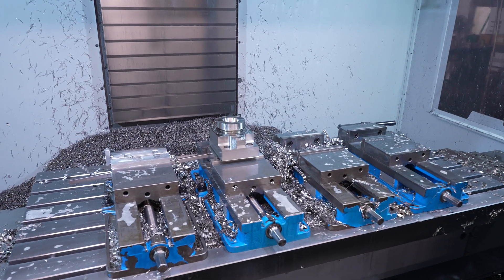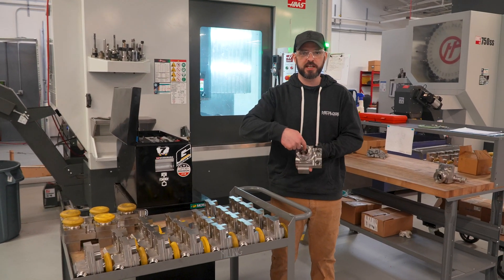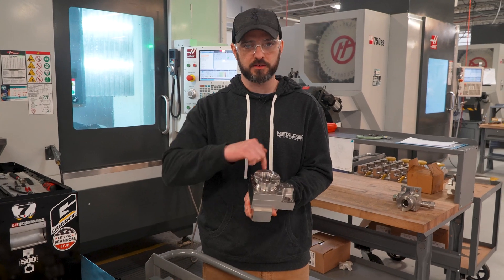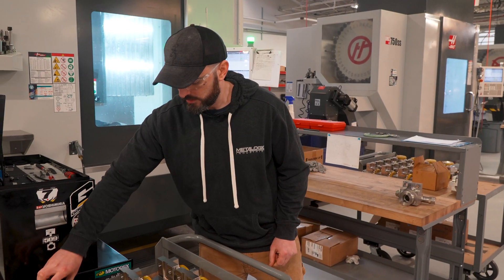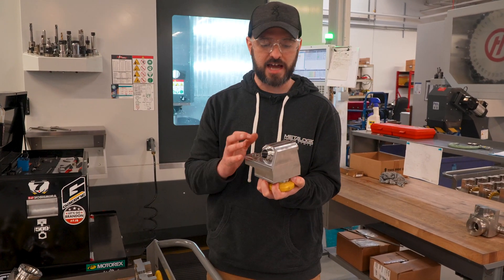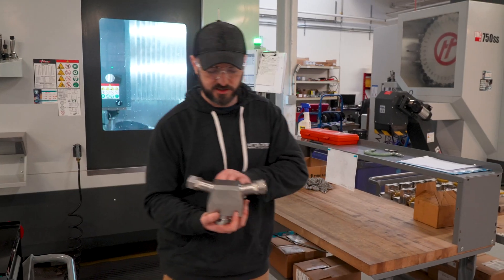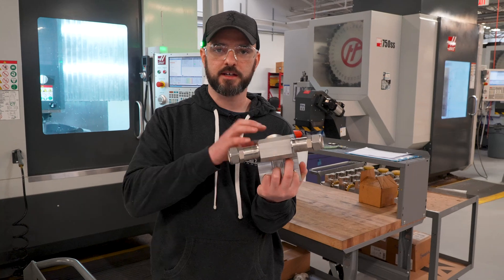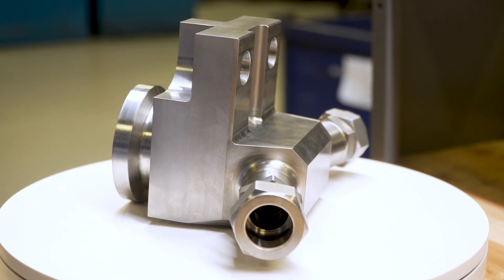Here we're a little further along in the process. We take the piece from that machine over there and we machine the finished inner surfaces and this outer surface. The UMC allows us to access this part all the way around, give us a nice finish on the floor and around this neck, which was hard to produce otherwise. After that operation, it goes into a custom design fixture and at that time we machine all these outer surfaces to finished size and position. This part goes from the machine shop to the welding department and back into the machine shop. Here you can see a piece that's been finished TIG welded. We have these connectors on the side. These go out to get x-rayed — and this is a great example of Metalogic from start to finish: machining, fabrication, welding, and complex inspection.